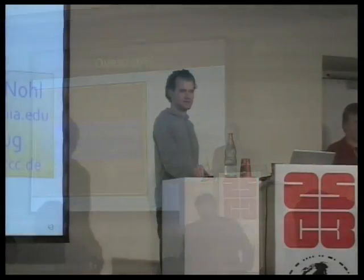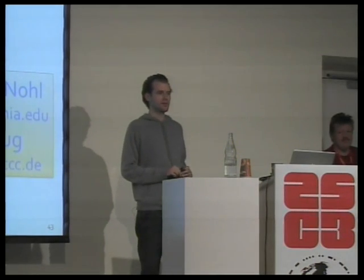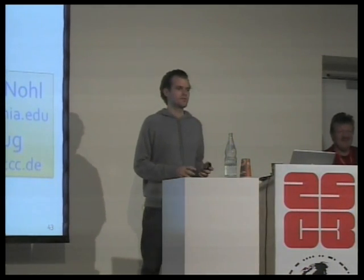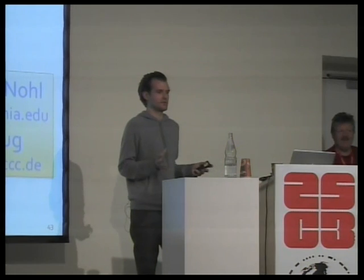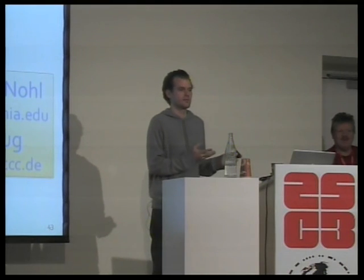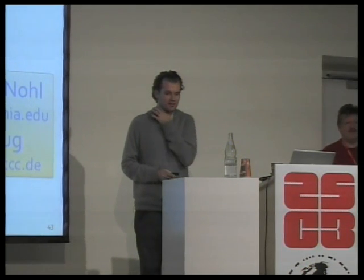We couldn't reverse engineer it with the tools we have, but there's imaging technologies such as a focused ion beam that can image basically anything that can be produced. And in fact, if you could produce a microchip that nobody can image anymore, you wouldn't be able to debug it. So it's crucial for the process of making a microchip to be able to reverse engineer at least parts of it. Every microchip fab will have a reverse engineering lab built into it. We don't have a FIB, but we have access to one, so we can break pretty much anything if we want, yes.